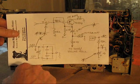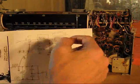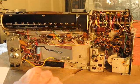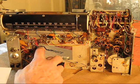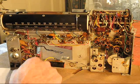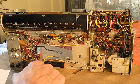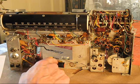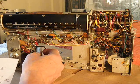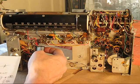This one, well, the position of these, as far as how they're mounted in this chassis, they're not easy to get to like these guys are. So, looking at where these are in the circuit, I don't think they're the cause of the problem. This one might be. This one definitely not. That's just a power supply filter. That could be open. I'm putting DC in. It's working. I'm seeing no hum, so hearing no hum. This one could be. I'll take a quick check of that before I swap it out.